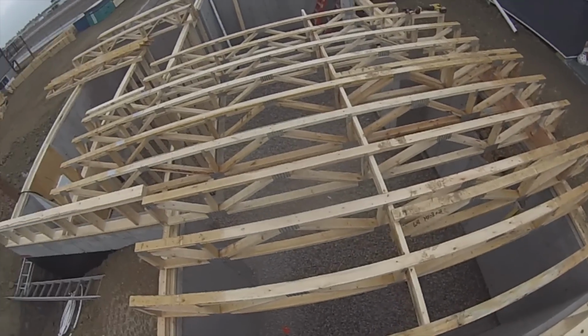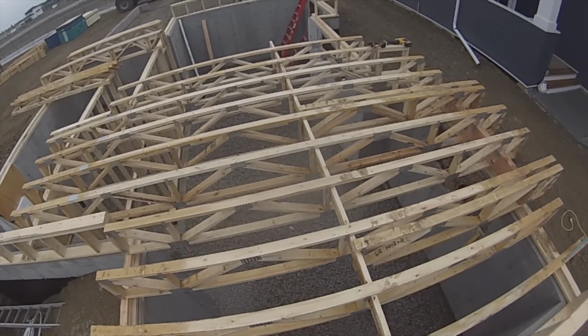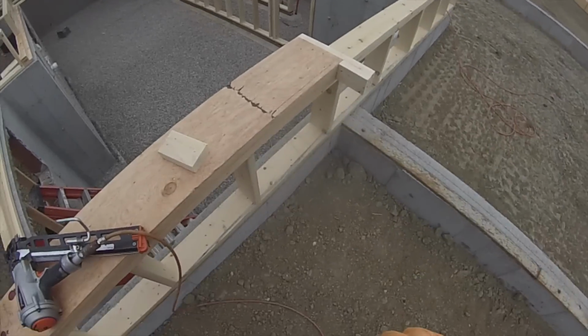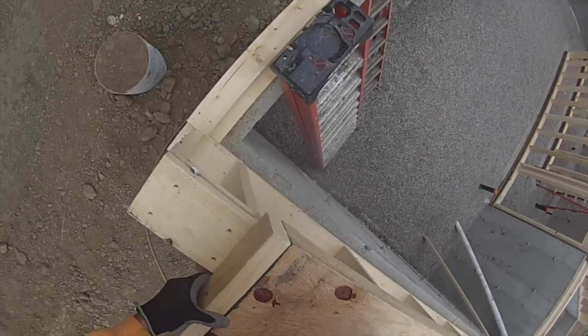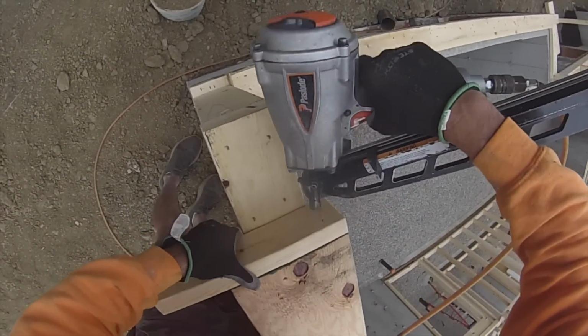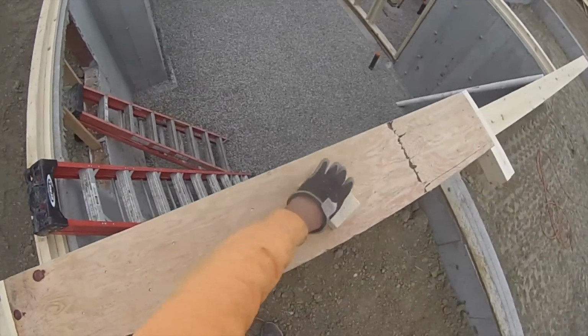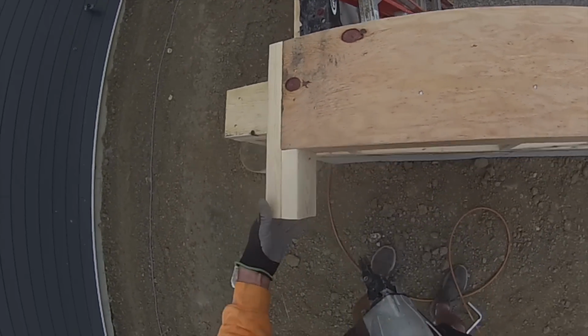That's not fun. So now I'll get all the rest of the trusses brought over and slide them all into position. Nope, I got two headers to build yet. We'll do that first. All right, so here's the header. I got it nailed. So now we put a 15-inch block here. A post, I guess. This is the squash block or the cripple, the bearing part.